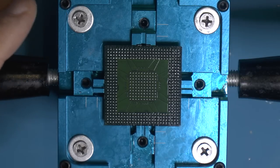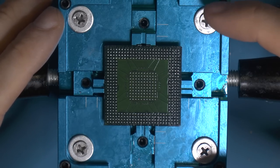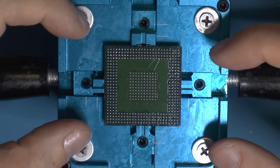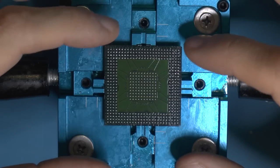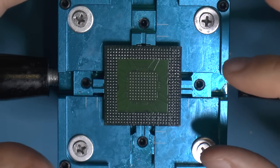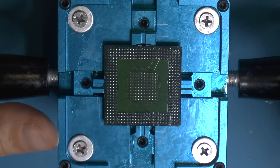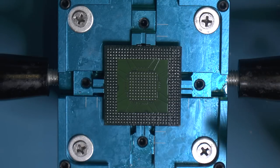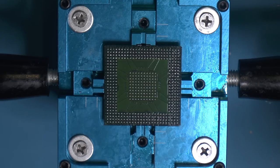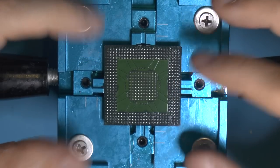And the thing is, like I said, my vision has gone to crap over the last year. The couple of projects I did before this one were really problematic, so I had to use some aid. I had to use my magnifying glasses, so when I looked at this with them, I could see some issues. It's hard for me to see when the solder melts. It could be glossy, but if it's dull, you can see it going from dull to glossy, and you can also see the balls move into place. And it's easy to see that on a camera when someone films in 4K with a professional microscope, but if your eyes see double and everything is fuzzy and you have to use some kind of aid, it's difficult for me to see what is happening with the balls.